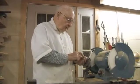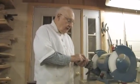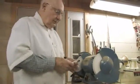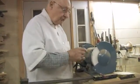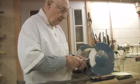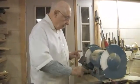scraping tool, which is used to clean the surface of the wheel. Will tear the surface of the wheel off, and you can see it turning white now. This rest must be presented over here on the wheel like this in order to tear the surface off. And when you cut the surface off, it will turn white, just as this wheel did.